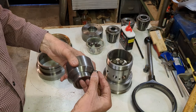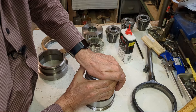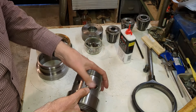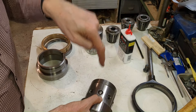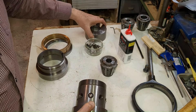So let's try and get the sleeve back in again squarely. I've tried this several times and it's actually more difficult than it looks — it falls out when you don't want it to, but when you push it in, unless you get it bang on square, it doesn't want to go. The nine balls go around the circumference like that, and you can see as that moves back the balls come out. Conversely, as the balls are pushed in radially, the sleeve moves forward, interacts with the collet and the adjustable end cap.